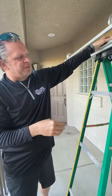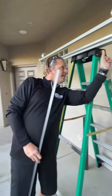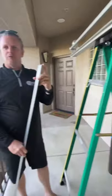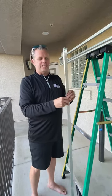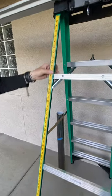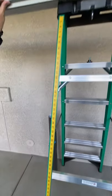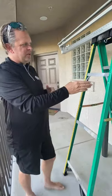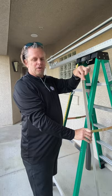As you're setting up your film handler, all 72s and 60s come with this ruler with a notch that fits in a little recess right underneath here. One thing I do personally — I don't like this thing because it's one more thing laying around. I always set up a fabric tape measure that's permanently fixed to the ladder, in perfect conjunction as your film goes down for the cut line. Makes it so you never have to break out a tape measure or that ruler, and if you've been in the industry a long time, you know that these rivets undoubtedly get worn out and sloppy.